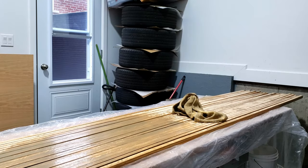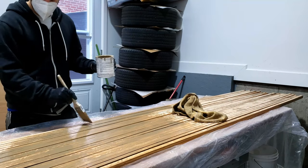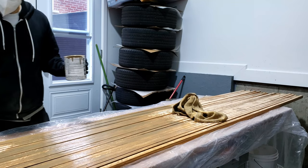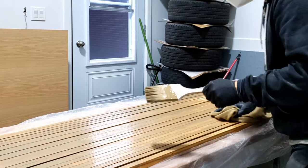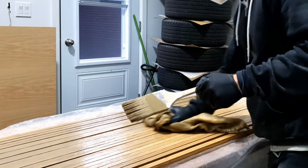On this step I'm applying the finish. The finish I used is from Easy Solo Alinea. It's a monocoat oil for wooden floors actually, and I was recommended this finish by my local wood shop. It applied very easily. All I had to do was wait five minutes and then wipe it down with a cloth.